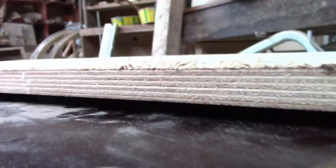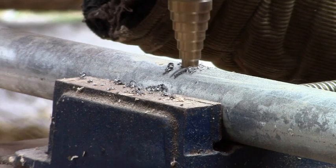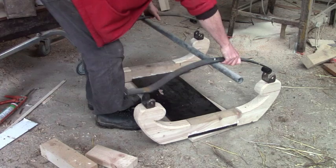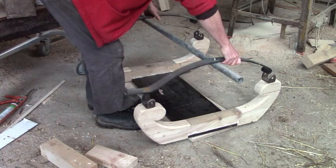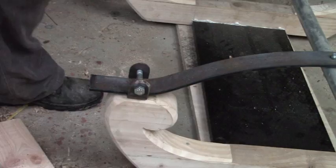The axles are galvanized steel pipe. I used a cone drill to make some holes in it and then just ran a bolt through the pipe and the spring. Here's the front axle set — it turns, so I guess it's called a dolly or a bogey. Lock nuts hold things together front and back, and you can see the movement the end of the spring makes as it's squashed.